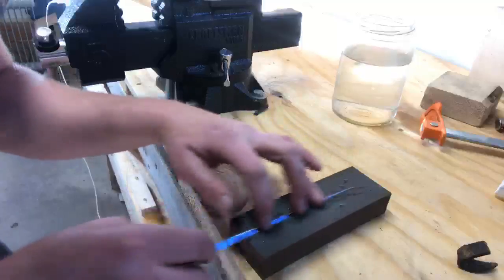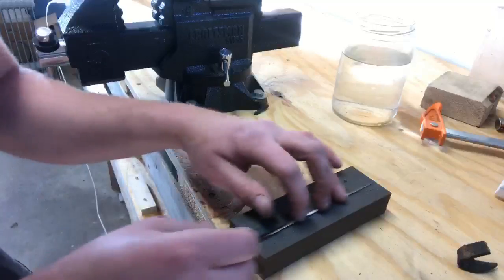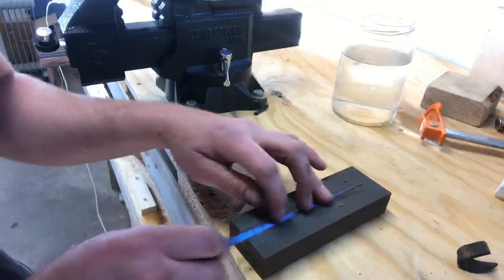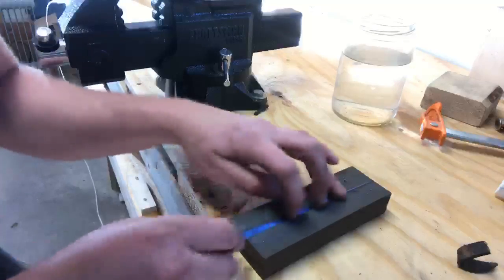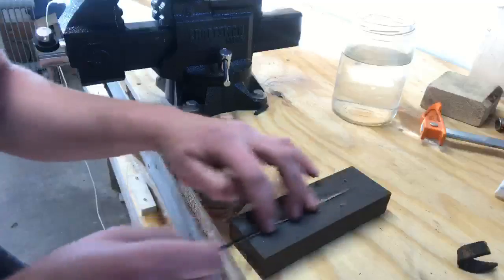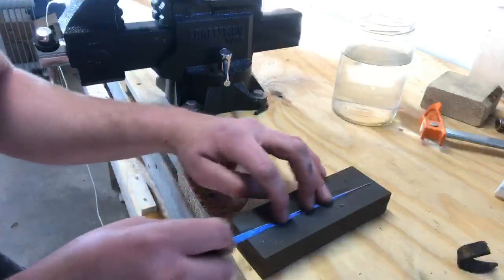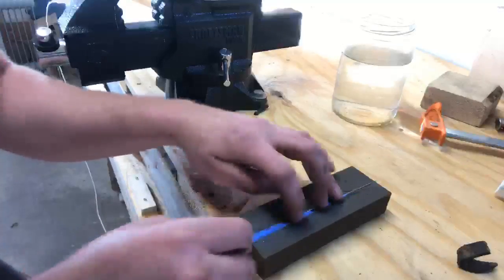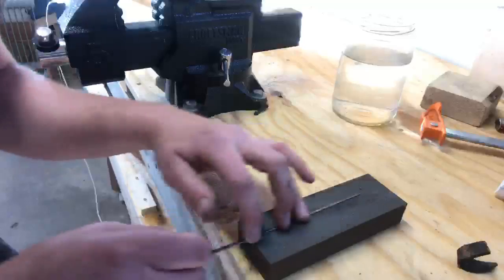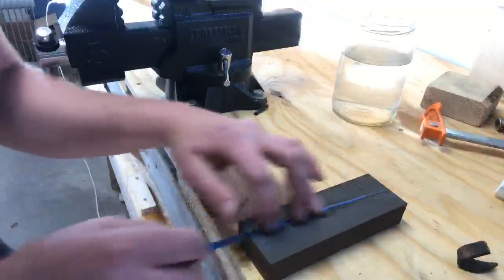and finally hone it. People have told me, well, why don't you do all your metal removal by hand with a file or on a stone? Well, that takes a lot of time. I found that using the grinder to remove the metal and get your edge profile right, it's 10 times faster, and then your final honing is easy. And it's easy once you get really good practice at this, especially on the grinder, to do perfect edges.